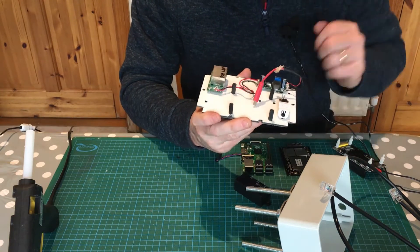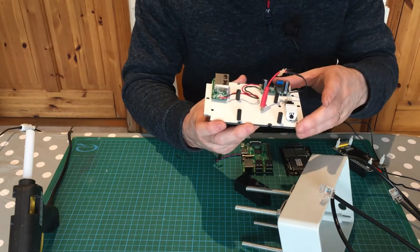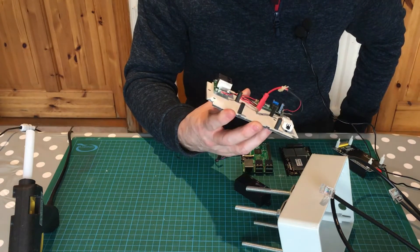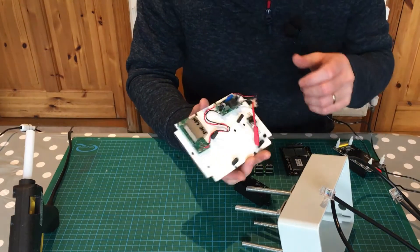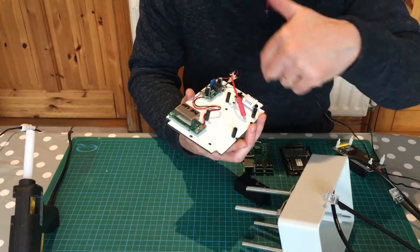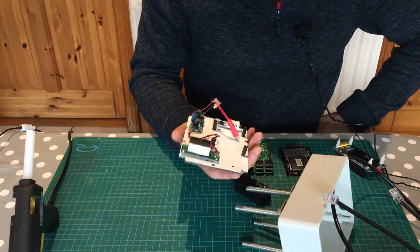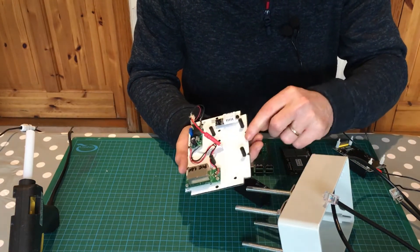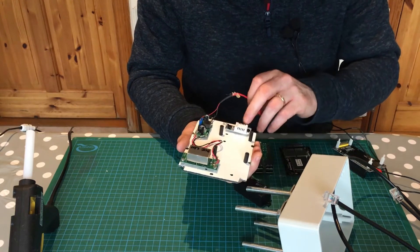To monitor temperature and humidity inside the box, I have a DHT22 sensor connected to a GPIO pin on the Raspberry Pi. If the humidity goes too high or stays at 100%, it'll ping me to check it. The mounting plate is a rough-and-ready piece of Dibond with things bolted on as needed. I was going to do a laser-cut acrylic mounting plate but the laser cutter at our local fab lab is out of action. I've pre-drilled spaces for the Raspberry Pi, the PoE module, the DC-to-DC module, and the temperature humidity module.